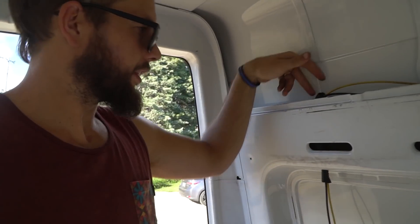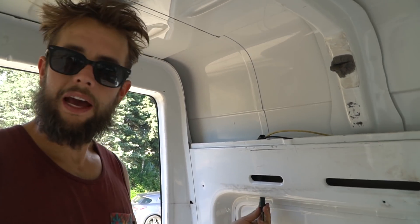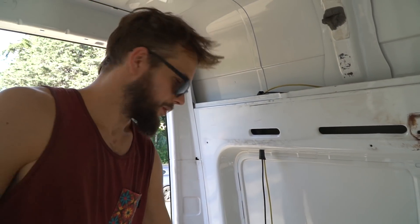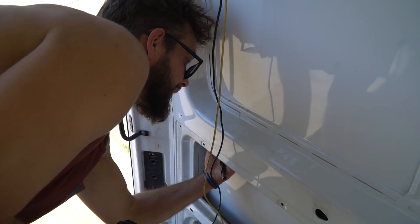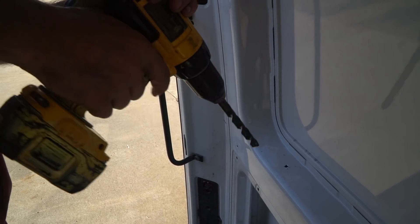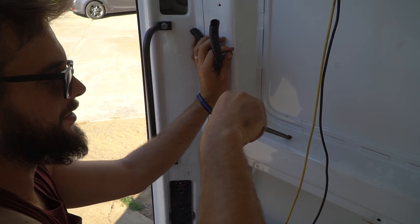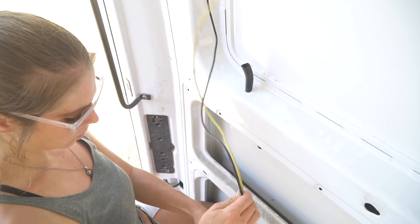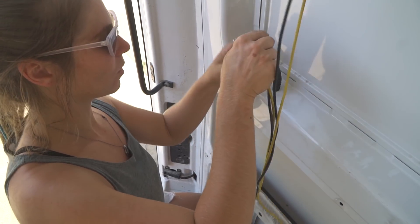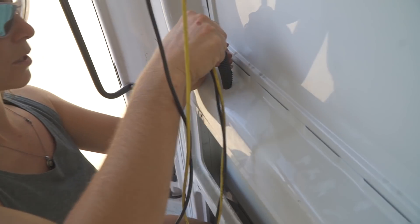To get the cords back behind the wall and behind our insulation, we've got to drill some holes and add plastic conduit. Start with a small pilot hole, figure out where you want it to go, then throw your bigger drill bit on and make the hole big enough to fit your conduit. Then grab a file and file down the rough edges. Ideally you want to paint what you just cut so you don't get any rust, then feed your wires through the tubing so they are protected.